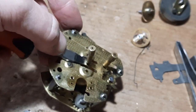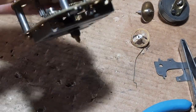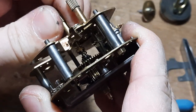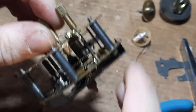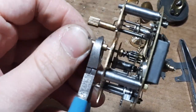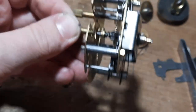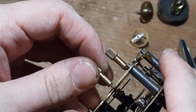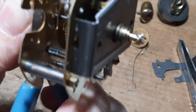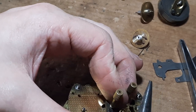Looks like we bent it a bit, but the metal is quite soft so that's not all that rare. Because we're bending it and it's obviously so stiff, I'm going to re-bend it and try out my usually last resort method, which is the old crush method. Now these are pressed on, so often gently crushing the very end of these brass parts here disturbs the friction grip, the press fit on them, and that makes them easier - because crushing them like this kind of resets the gripping force a little bit. So let's try it now.